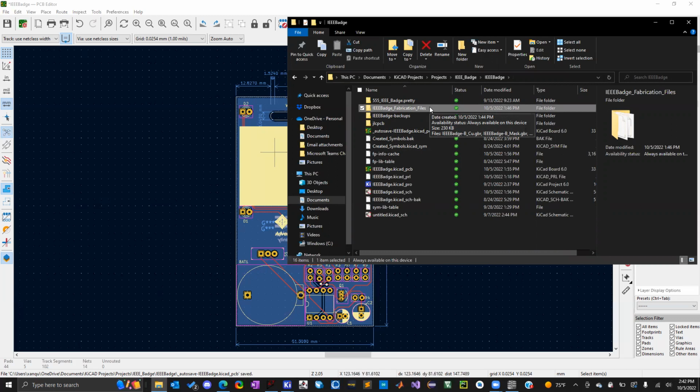There's mainly just two file formats. It's Gerber and DRL for the drill holes. So they'll have you upload the Gerber file, and then they'll have you upload the drill hole files. Or they'll want it all together in one, and you just zip the folder and upload that. And then they'll unzip it. When they open up your Gerber, they'll see the PCB design you just made, and they'll also see the position of every single hole they have to drill in the board. That's every hole for every via and for every through-hole component.